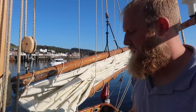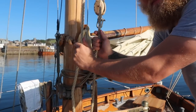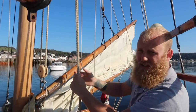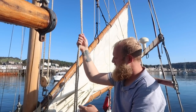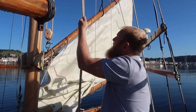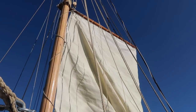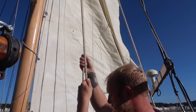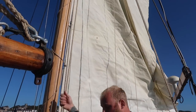We always keep the peak higher than the throat. I'll start sending it up — we've got the two here, throat and peak, and the mizzen has hardly any weight. First I pull the peak up a bit. Because of how it's roved, the throat is a lot shorter than the peak so as I start pulling, the throat will catch up. You can already see the throat catching up with the peak, and I've set it up so I can get all the way to the top. Now the throat is going tight, so I'll tie the peak off and sweat in the throat to get it nice and tight.